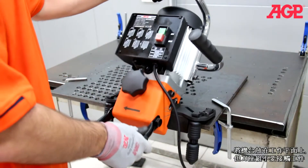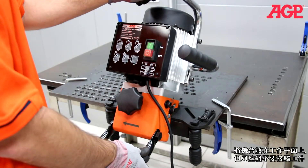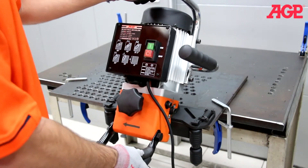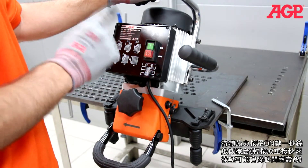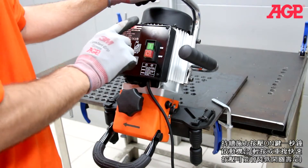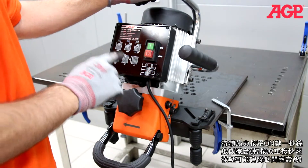Place the machine on the plate with the milling head not touching the workpiece. Start the machine by firmly and deliberately pressing the on button for one full second. A light, quick push could shorten the life of the switch.